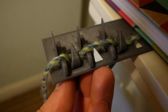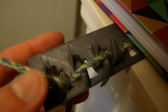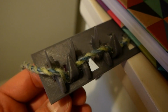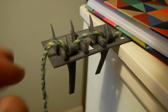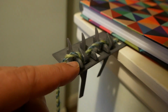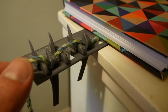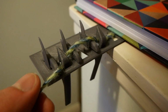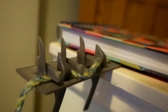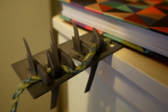This needle has to be able to pull this all the way down, kind of like that, but at the moment it gets jammed there because of the thickness of the line itself. So that's problem number 1. Problem number 2 is this curve here is starting too far on the edge. It needs to be further back, because when this pulls it down, this is supposed to slide along there and down. Overall, it could do with having a bit more space everywhere, so I think I'll make the whole thing a bit bigger.